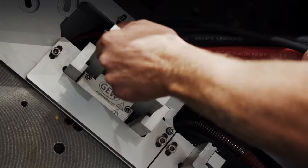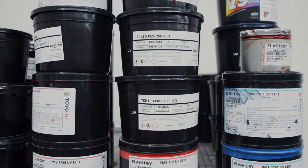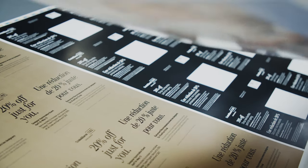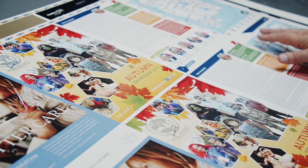I'm not blowing smoke here or kidding anybody — this installation was very fast, one of the cleanest installations I've seen in 30 years of being in the printing business. We're running probably on average 3,000 sheets per hour faster than we were, and it's a bigger sheet, so we went on both ends — producing a larger sheet with more print on it at a faster speed. UV inks are more expensive, but if you picture printing a big job and having 10 skids of paper sitting there for 24 hours so they can dry before you can do anything with them, that costs you money. When we turned our LED system on for the first time and ran our first press sheet through and realized the sheet was dry — no coating on it, it went right through the press — it was like magic. Everybody looked at each other like, the game has changed.